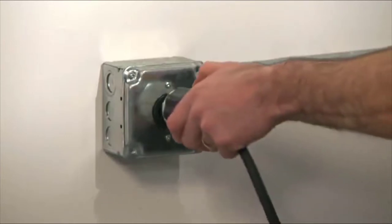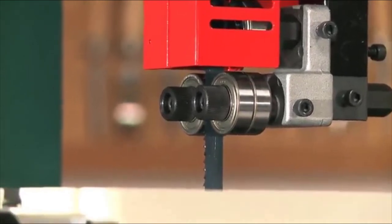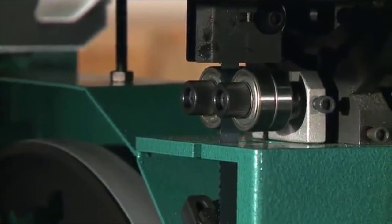Note that the table alignment pin ensures the workpiece does not catch on the slotted part of the table. Plug the cord back in and you're back in business. Also featured are double ball-bearing blade guides with full enclosure protection. These bearings run cooler and are extremely wear resistant over standard guide blocks. The cutting capacity and width is 16-1/4 inches.